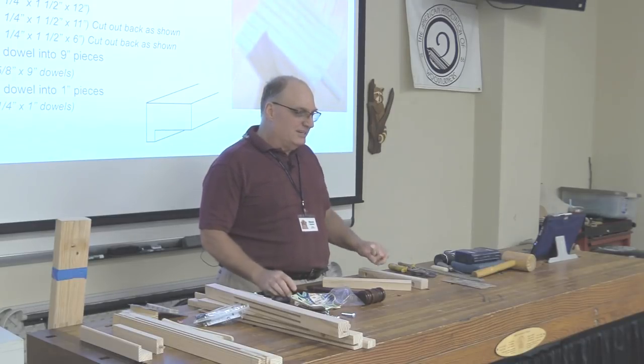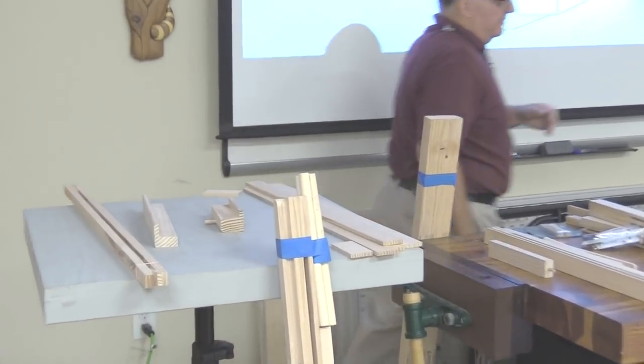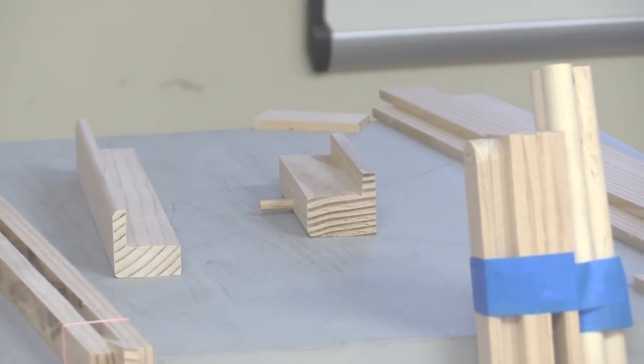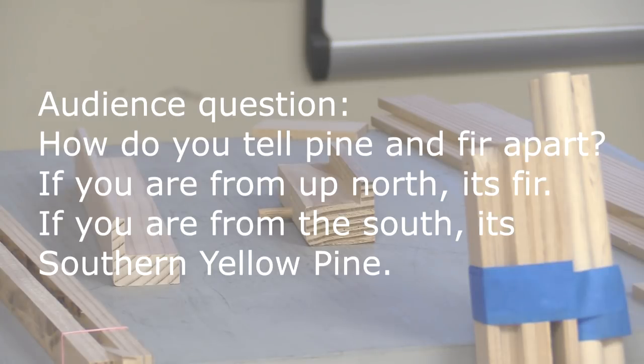The only machining that this needs would be for the bottom and the top. And again, if you want to just keep cutting it out of the same pieces, or you can just glue a piece of 1/4 inch stuff to a piece of 3/4 inch stuff and make that. In the end, I like this, just because I could do it on the table saw really quick.